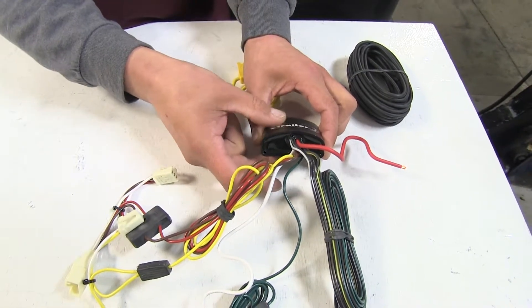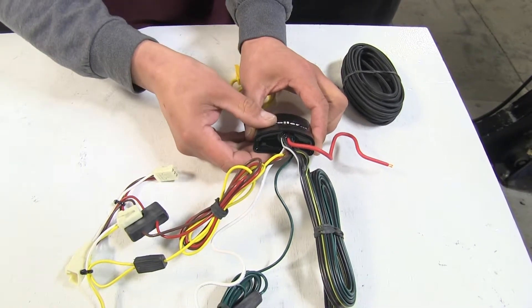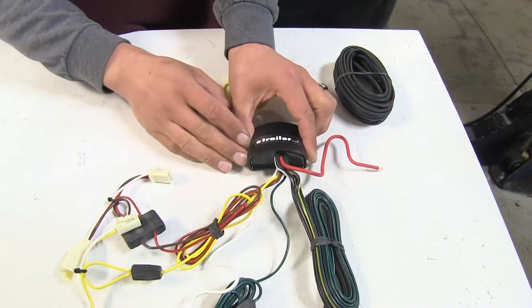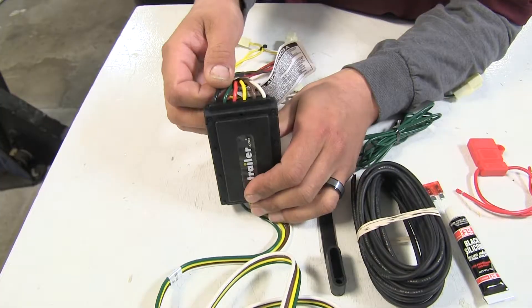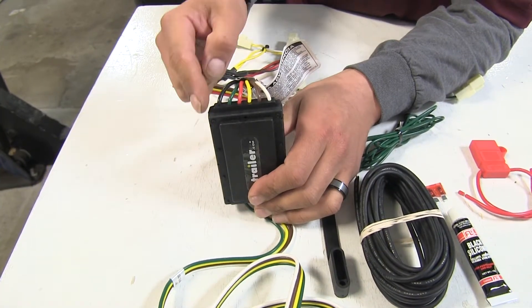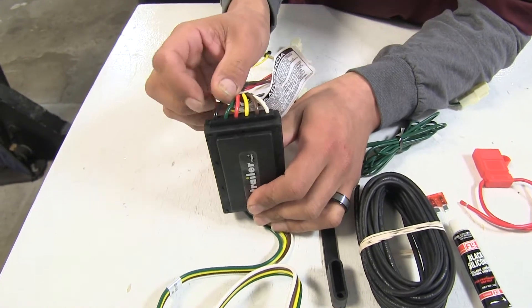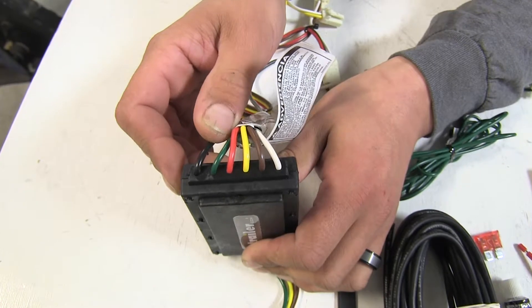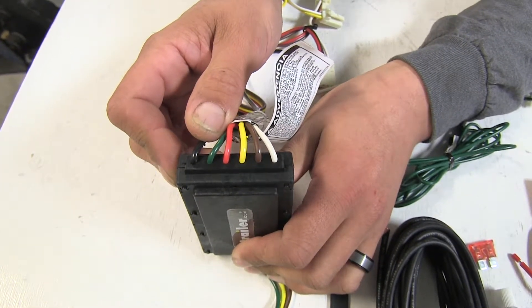That's going to be a potting material, and the entire converter box and all the circuits inside are going to be filled with it, which is going to make it resist any kind of vibration, as well as any kind of weather and moisture from getting inside. Opposed to the Curt, where the wires just go straight into the converter box, and if you pull on the wire you can almost look into the converter box itself, which opens up areas for moisture or anything to get inside.